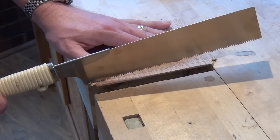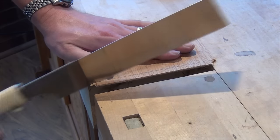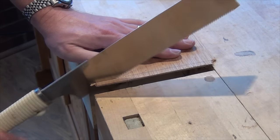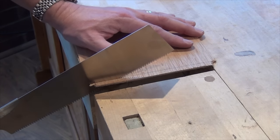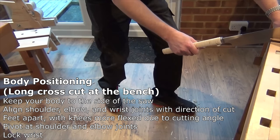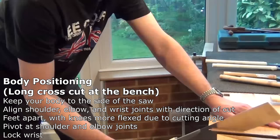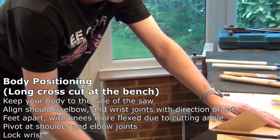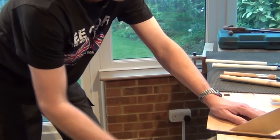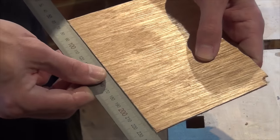I'll start with some light strokes at the beginning of the cut, lining the blade up as I make these. Although there's a certain amount of steering you can do as you cut, the best thing is to get everything lined up first of all. I'm using roughly the same stance as before but standing a little bit lower, same locked wrist — and it's just the elbow, and in fact mainly the shoulder, that's swinging. That gives me a very decent cut, nice and quickly — a couple of strokes of the plane and it'd be perfect.